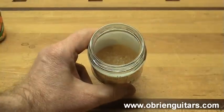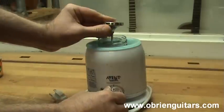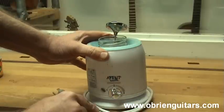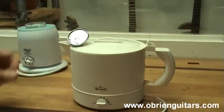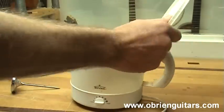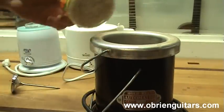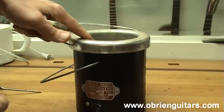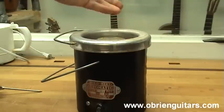There are several ways you can heat the glue. Here's a simple baby bottle warmer — fill it with water, place the jar in it, and dial in the thermostat. If you place a thermometer in it and notice it gets to 145 degrees, put a little mark on your baby bottle warmer and it will maintain that temperature constant. You can do the same thing with a little pot — drill a hole in it, place your thermometer in there, and mark it when it gets to 145. You can also just float your jar inside the pot. And yet another way is with a commercial glue pot — fill it with water and it has a thermostat that constantly maintains the temperature at 145 degrees Fahrenheit. Float your glue in it, and I like to place a cap on it but leave it on loosely — don't tighten it.